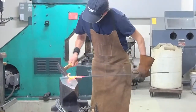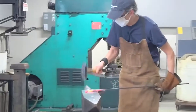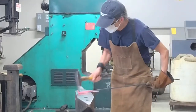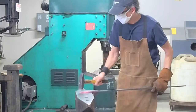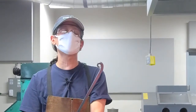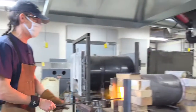I'll use a little lighter hammer now and start that bending-down process — kind of rolling it over, straightening it out. It may look like I'm randomly hammering but believe it or not I'm thinking about every hammer blow and what it will do to the shape I'm creating. I've made a decorative curl — kind of a curlicue for lack of a better term — for the end of the handle. It's a little nicer than just a plain blunt end, a nicer transition.